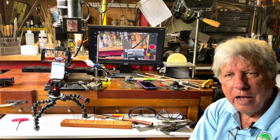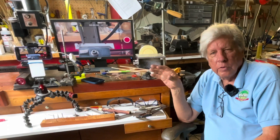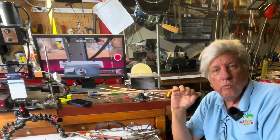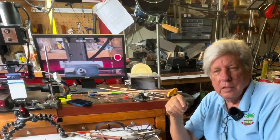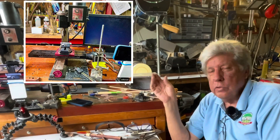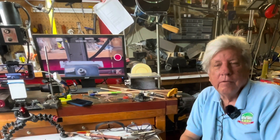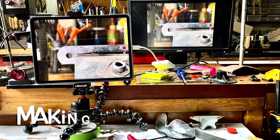I can zoom in and really get to look at the work in great detail — it has changed my life absolutely. The oversized tools I have, although still too big, I can find a way to skirt around the problem by making very small cuts. I was using the turbo carver to clean up and reshape the rounded surfaces, but that didn't go too well. So I decided to turn the mill back the correct way, use the same bits in a Jacob's chuck, and do the horizontal surfaces. I now have total control cutting the molding pieces out of the saw blades.